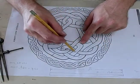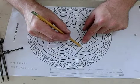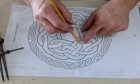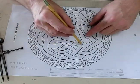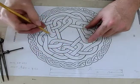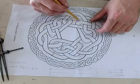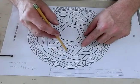Then we got to make this 90 degree or a little bit more than 90 degree bend. We're not going to try to do an upset corner, so this is really going to look more like this. It's going to have more of a rounded corner on this corner. It's not impossible, but I don't want to go to the trouble of doing that. We're just going to bend the stock as it is, not try to upset the metal into this corner. So, like I say, in reality, this is going to look more like this on these corners here. Will be more rounded off. This one actually is drawn more rounded in their drawing, but it'll be a little bit more than that. And then we'll have this piece sticking straight out this way.